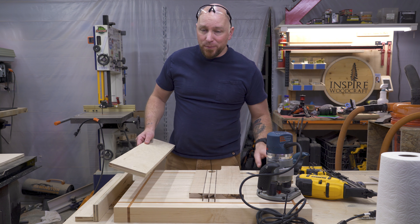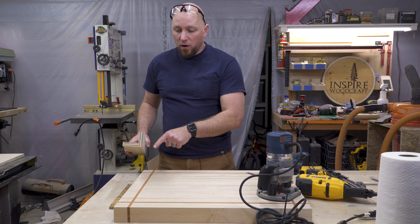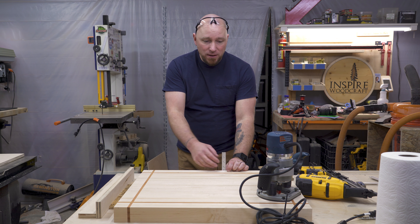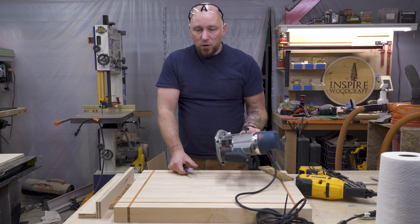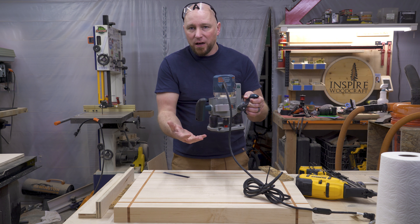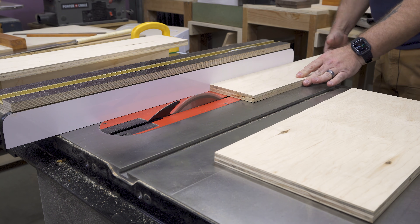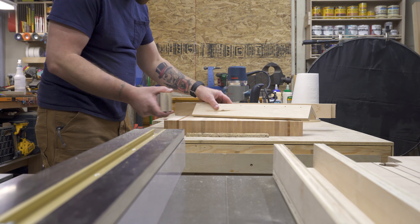What I'm going to do today is even more complicated than what you would have to do. The first thing I need to do is make my bumpers, then we can move on to the parts that actually lock our board in. I just need to know basically the thickness of my project — measure the thickness and add about an eighth inch. We really only need the bumper sticking up just a little bit; if we make it too tall it might get in our way. In my case that's about two and a half inches, so I'm going to cut a bunch of strips at two and a half and nail them together into 90-degree pieces — two roughly the length of my board and two roughly the width.